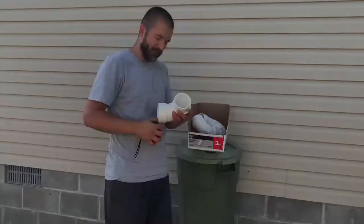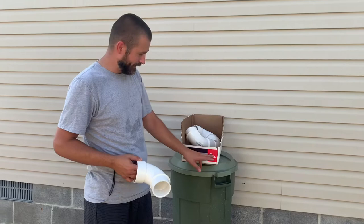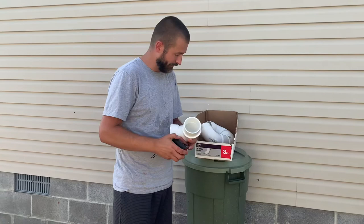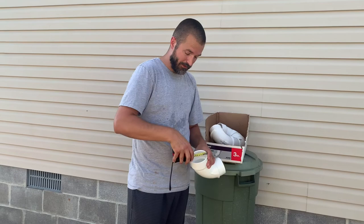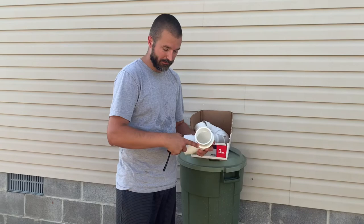One update I wanted to do for this video was to explain this connection because it may have been confusing in my last video. I believe I said this was a four inch street elbow - I wanted to clarify because at the store this is actually considered a three inch 90 degree street elbow. Three inch signifies the inside diameter. The outside diameter is four inches on the large end, and the small end should be three and a half inches.